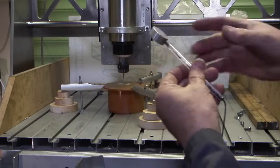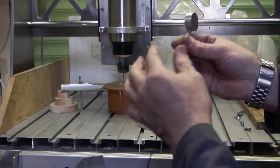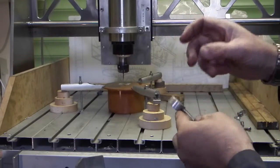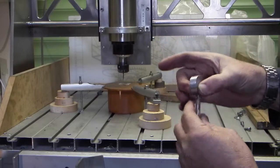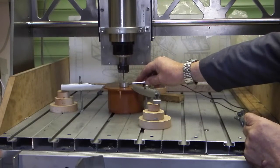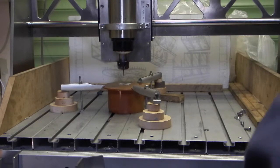We start off by setting the tooltip to zero on the CNC machine. There's an aluminium set distance piece — set width — on a wire that touches there. When the tool touches the top of that it will back off and it knows the width of that in the computer. The computer has now zeroed the top of that plastic.